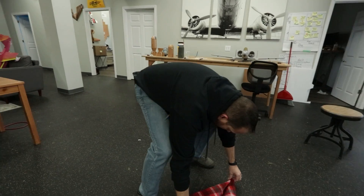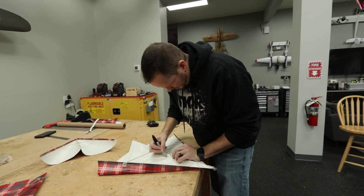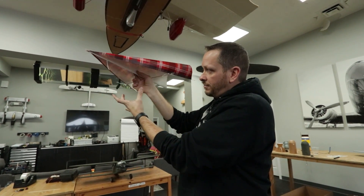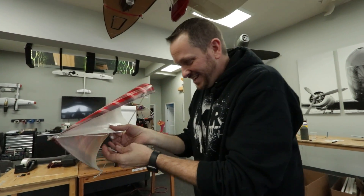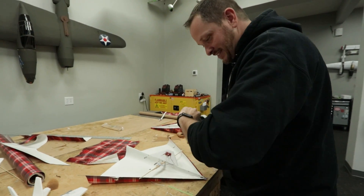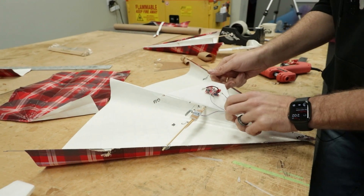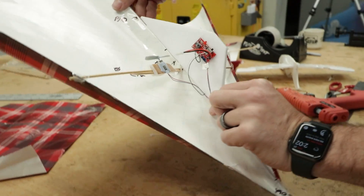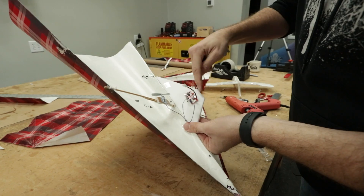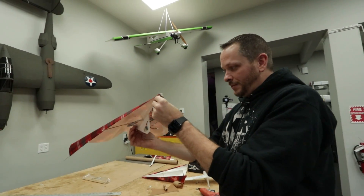What we're going to do is take what we learned here. I'm going to get this to fly as nicely as possible, put the little nut on the back, find out where my center of gravity is, mark it, and then as I scale up that'll be my range for where the motors will be. When we give it power it will climb, and when we cut the throttle with no power it'll glide real nice. I've got our two motors from the EasyPack and I can move these in and out to get the leverage I need to turn. It's just ahead of the CG so I'm pointing it down a little bit to counteract that. I cut this angle piece down here to get the battery and control board as low as possible so the plane will have a lower center of gravity and hopefully be a little more stable.